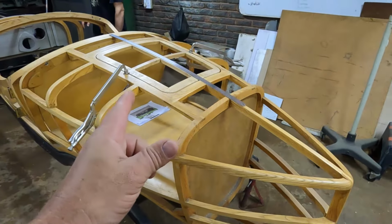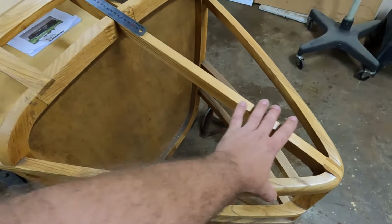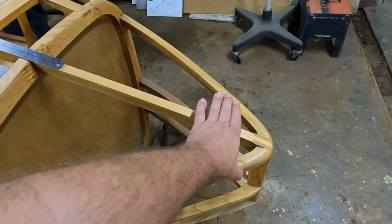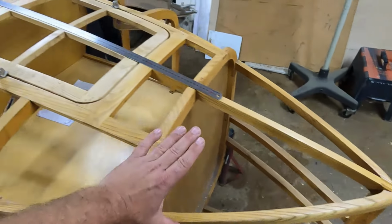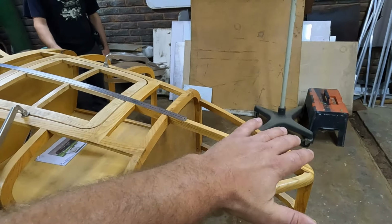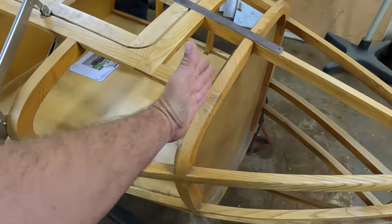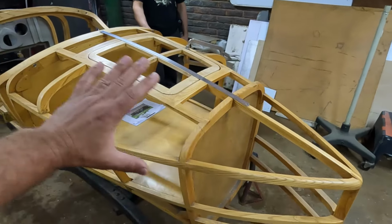Also, another thing that needs to be considered, and that's where a little bit of skill is going to come in, is that some pieces or parts of this body, like for instance over here, has got very little information. So we kind of need to understand how the aluminium is going to get shaped and how the form is going to move towards the back and also towards the front, so that we can have a nice clean line coming from the front to the back without having the information that we need on all of these open-ended pieces over here. So basically we only got these ribs as information, and we need to figure out what needs to happen in between that.